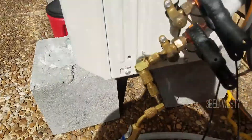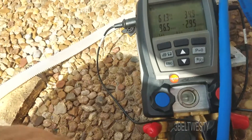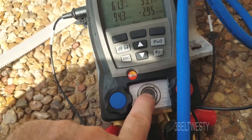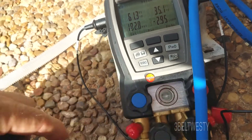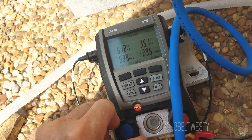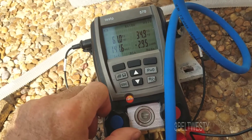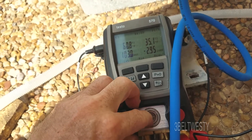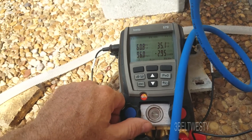That's why using a set of gauges like this is really kind of futile. The problem with adding a small amount of liquid gas is you can see it in the vial, and if I crack this open - you still have a lot in the line - so it's really difficult to gauge a small amount of what you're doing. That's why normally, with an unknown unit, it's better to hook up the recovery device, pull all the charge out, and weigh it all back in. That's the proper way.